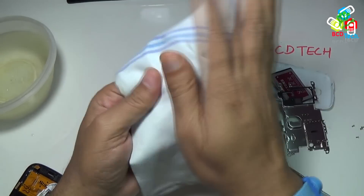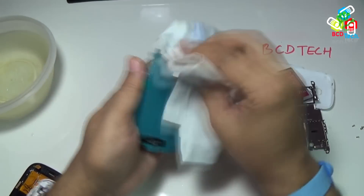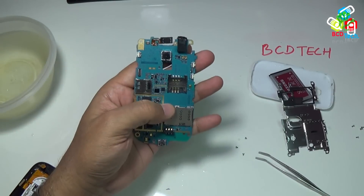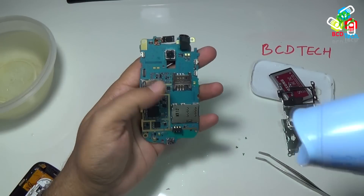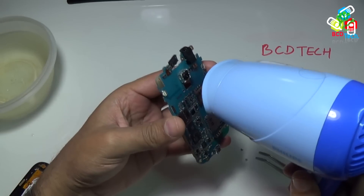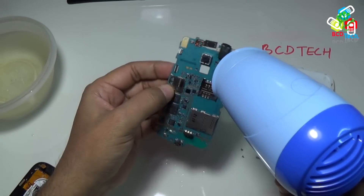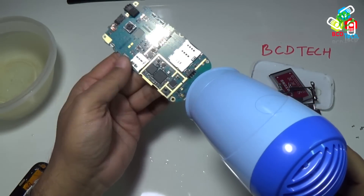The easiest way is to dry this with compressed air or hot air. First, soak the excess water from the board and use a cotton cloth for that — you can use your handkerchief. Go through all sides. This will make drying easy and fast. Now use a hair dryer to dry further. I am using a local Philips 1000-watt hair dryer. Go to the full setting — this will increase the air flow. In my lab, I dry these types of boards with compressed air. If you don't have compressed air, you can go with a hair dryer.